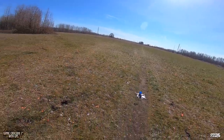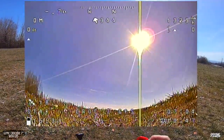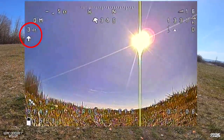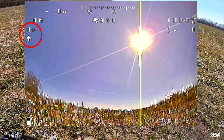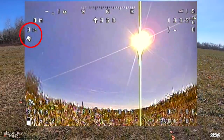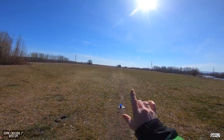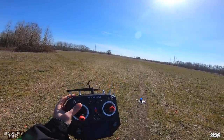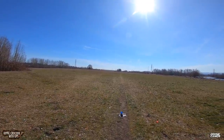One of the things they tell you to do in the wiki is arm the quad and wait for about 30 seconds or so. Look inside your goggles to make sure that the home arrow is working. I'm looking at my goggles right now and I do see that my home arrow is working. Also, if you're putting your goggles on the ground, make sure they're not facing into the sun because it will burn some green spots onto your screen. If the arrow was not working, that means when I flip this switch into rescue mode it will go somewhere else — so be very careful about that.